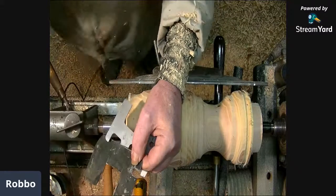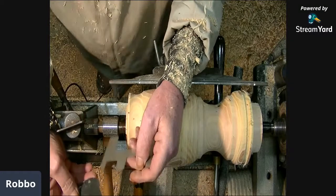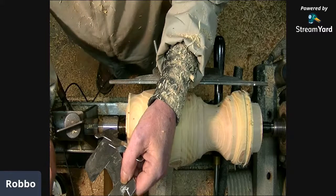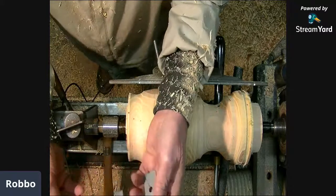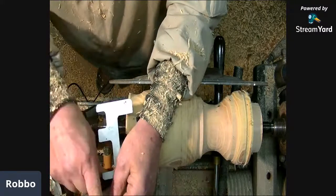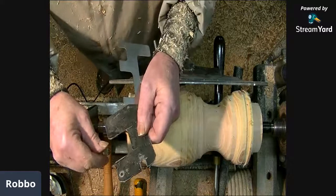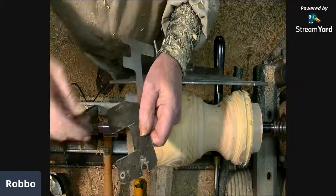Now, so those people know what's going on, Charlie Hillen put up on the Woodturners of Australia his pin gouges for doing the tenons and things on legs and things like that. You call them sizing tools or pin gouges or whatever. Like this one here is 10 millimeters. That one's 40. That was for a job that I was doing that had a 10 mil tenon on one end, and the bottom of the leg was 40 mil. So you just put them in.